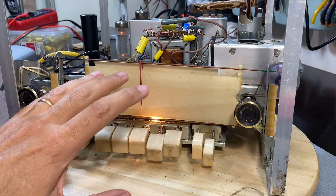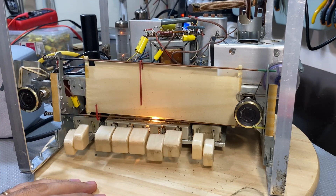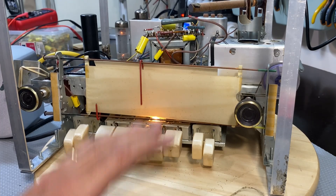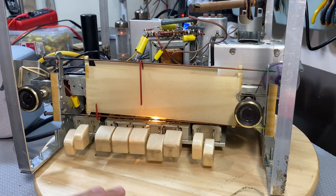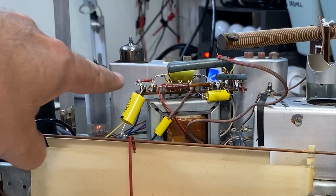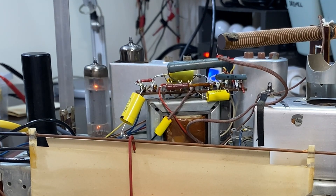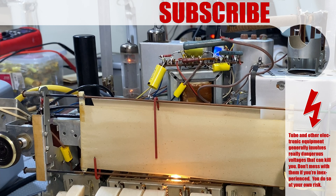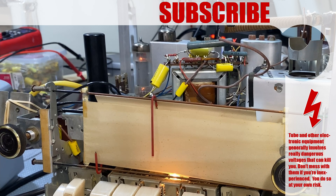That is the IF alignment. Next I'll be doing the RF alignment, but not now because I need to put the dial glass on there - it needs a bit of cleaning. I'm going to do that together with the RF alignment for the FM when I've done the FM, which will be the next stage. That should be quite simple because I don't expect major problems - this thing had very, very little wrong with the components. There's one capacitor I'll probably need to change: the discriminator cap, the electrolytic inside that box over there. I'll definitely need to take the lid off to replace that. I hope you've enjoyed this - if you have, click like, share, subscribe. If you want to support the channel directly, you can do so on Patreon. Thanks for watching, bye for now and stay safe.